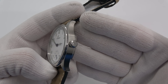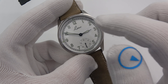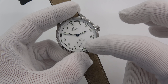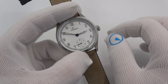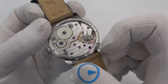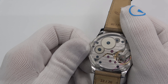It is really just a beautiful watch — look at the crown, the Laco L, the design of it. It's powered by the Unitas 6498; there's a 6497 and a 6498, and they only differ in the position of the sub-dial for the seconds. Basically considered the preeminent pocket watch movement of yesteryear, still being manufactured — Unitas is owned by ETA. It's a 17-jewel hand-winding movement, and such a satisfying wind when you wind it. You can see the gears moving.